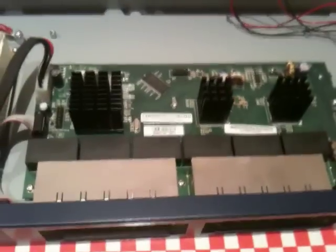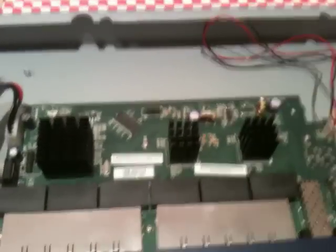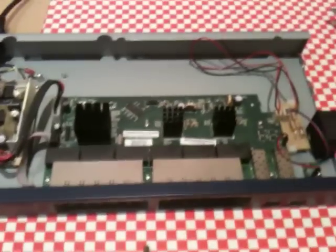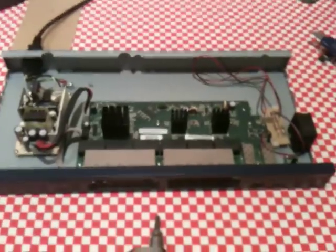I know it will because I've actually tested it without the fan, and the heat sinks, while they get very hot to the touch, don't reach stupid temperatures. They are touchable at all times, even when the switch is quite heavily loaded, so this reduced fan speed should be satisfactory. This will be going on a shelf and will be quite well ventilated, so overall the conditions should be satisfactory.